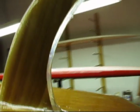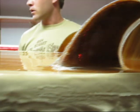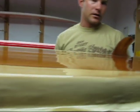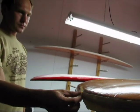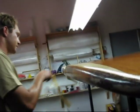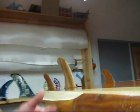So what are we looking at for a curing time on the hot coat? It'll gel if you activate it properly, within 5 minutes of laying it down. That gives it just enough time to level out. That's what the surfacing agent does. It helps level everything out. You can see it's nice and smooth. And now, as soon as it gels, you peel the tape. You don't want to try to hot coat without that wax, because you're just going to get that sticky, tacky, bumpy surface.